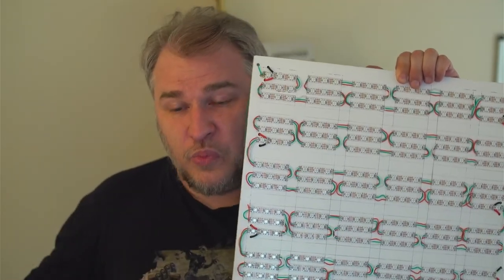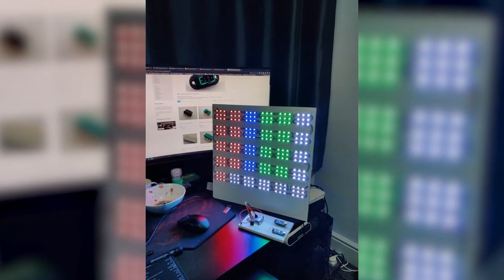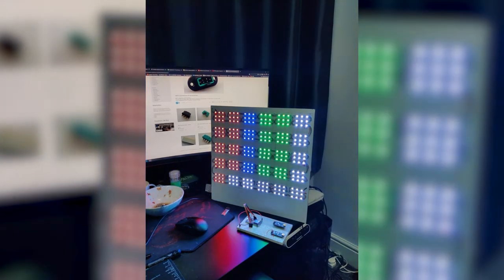And we've tested that. So to test this out, to make sure that the DMX patches were working perfectly fine, I created three strips of colors, red, green, and blue, in Unreal Engine, and animated the camera pointing at it and panning left and right. Outputted those to a DMX patch, straight to the LED panel, and it worked pretty good, right? So the proof of concept was there.